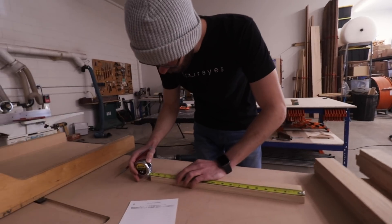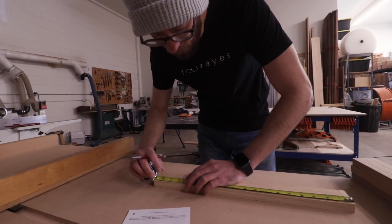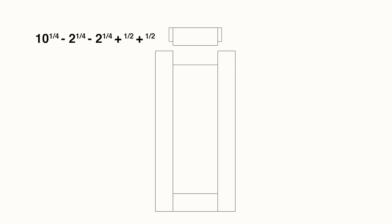In these next few shots I'm marking out and cutting our rails and stiles to their final length. I'm going to use a hypothetical panel with simpler dimensions to explain. Let's pretend we had a door that's 20 inches tall by 10 inches wide. I'm actually going to build the door slightly too big because I want to cut it down to its final size a little later - so we're going to aim to make the door 20 and a quarter by 10 and a quarter, a quarter of an inch oversized in each direction. For our stiles, the vertical pieces, we can cut them right to 20 and a quarter inches. For our rails, we'll need the finished dimension of 10 and a quarter inches, minus 5 and a half - that's the width of both stiles which the rail is sandwiched between - and then plus the length of the tenons. That comes to a grand total of six and three quarters inches.